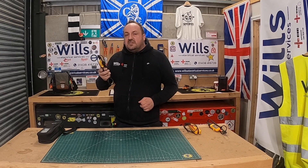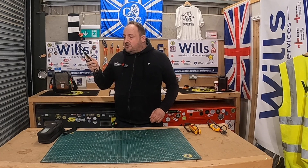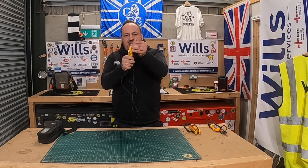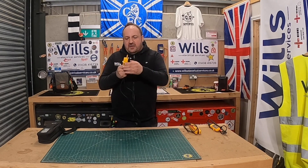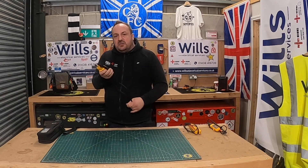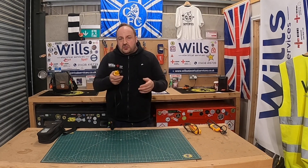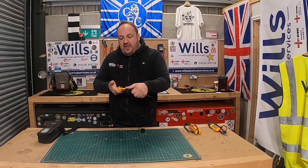One of the great things about these is the actual size — they're absolutely brilliant. They've got a pouch to keep the tops on so it stops you from stabbing yourself when you put them in your pocket. They also have covers on the prongs that you can take off to make the prongs a bit bigger — I think the maximum is 4mm. You can also put one in the holder part when proving dead at the main switch. It's rated up to 690 volts, well above our normal 400-415V.